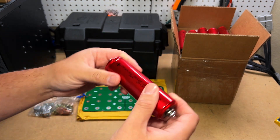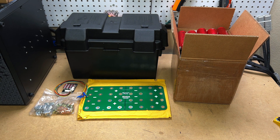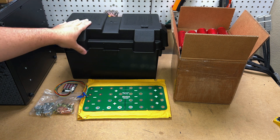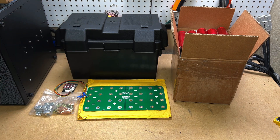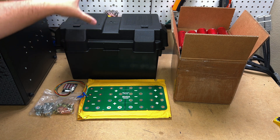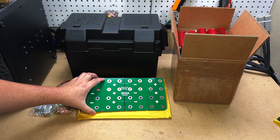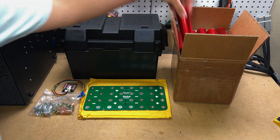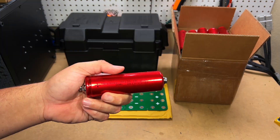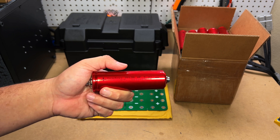You're going to need something to hold the cells in. This Group 31 battery box from NOCO will fit the bill — I don't need anything extravagant, just something that works, and this does that for about $15. The expensive part is often the bus bars. Custom milled bus bars are very expensive, but you can also buy inexpensive copper bus bars that come with the cells for around a dollar each.